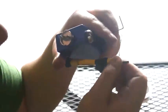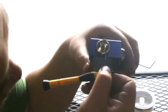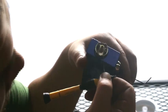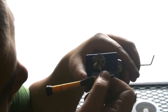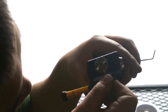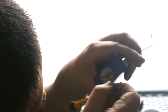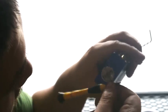See how I keep one lead longer than the other? The reason why I do that is because it makes it easier to install it. So if I put the long lead in first, I can have that in the coil inside the post securely while I guide the second lead in, without losing the first one inside of that one. So it seems like it fits 3 strands of 26 gauge in there pretty easily, actually. I could honestly dual this if I really wanted to, but we're not going to do that today.